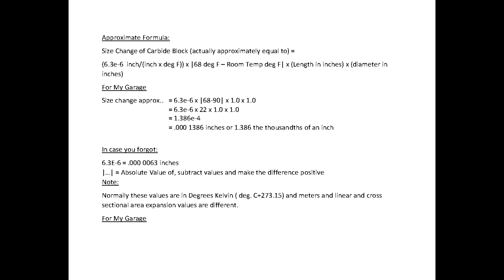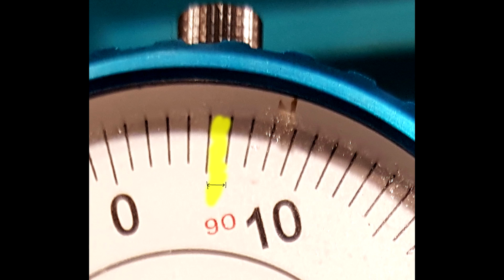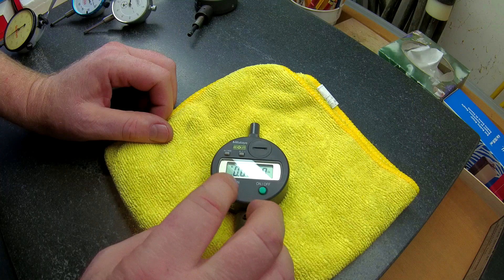This suggests my largest block should read less than 1.00014 inches in height. For the most part we can ignore temperature expansion as a significant error source, though if many blocks measure noticeably bigger than stated we may need to revisit it. For the ten-thousandth-resolution indicators this could be an issue, so factor that in. Second: I will estimate all dial readings to the next order of magnitude by interpreting needle position between lines — take these values with a grain of salt.